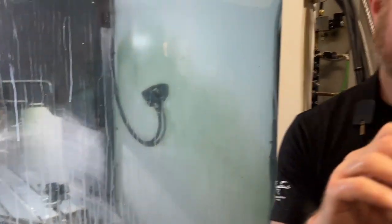In this operation we're working on the beak and some of the outside body — going very fast. But when we do the facing curve, the table, and the facing curve, we'll be barely moving. The slower you go, the more accurate you are. On a non-playing part of the mouthpiece we can go kind of fast, but we make up for that by going super slow on the critical parts. That sound is the machine — it makes its own kind of music. Each mouthpiece has its own song.